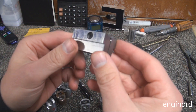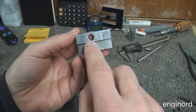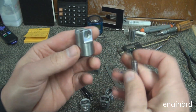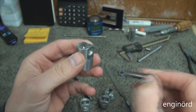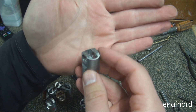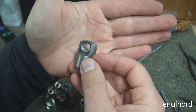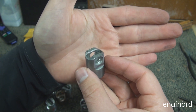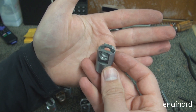This little fixture worked out well. I made a matching pin - this is an 8.33 hole and this is an 8.19 pin, and then these holes are 8.2, so it's got a nicer fit. Everything worked out nicely. Now, I mentioned before that some of these tappets are not fully grown so the depth of the pocket is not to print, but I still want to move these through the machining process and learn as much as I can with these rejects.